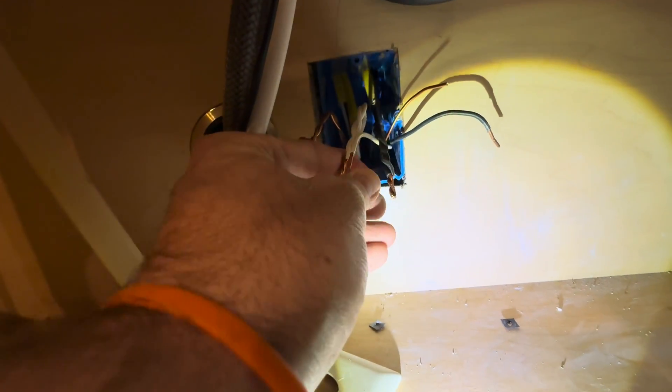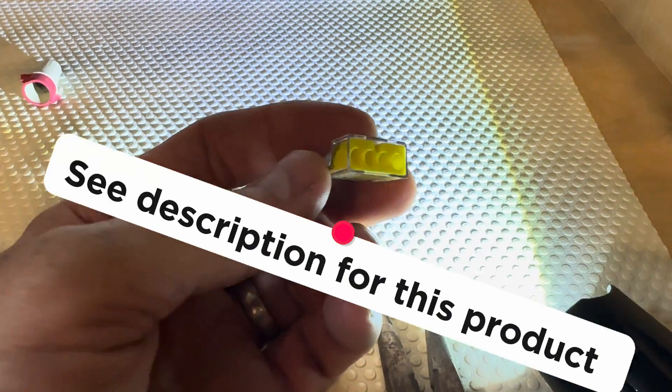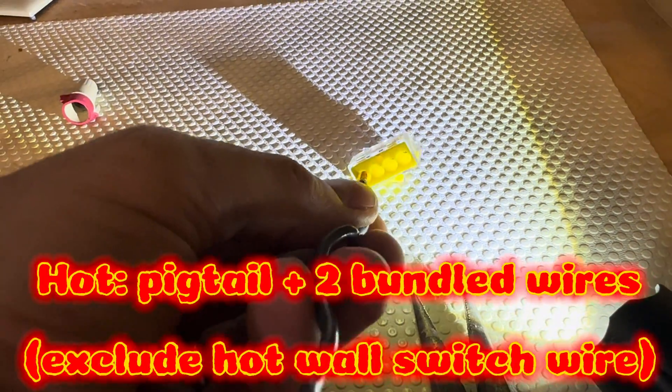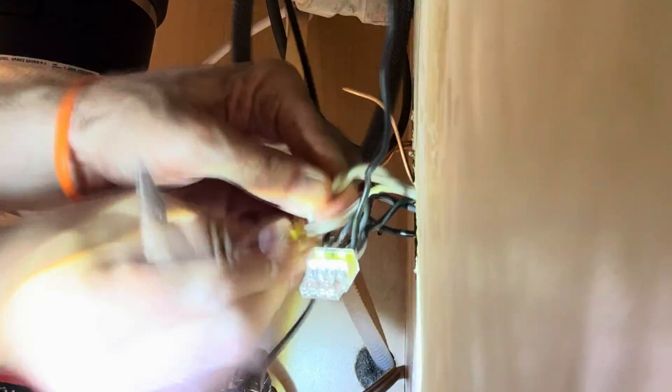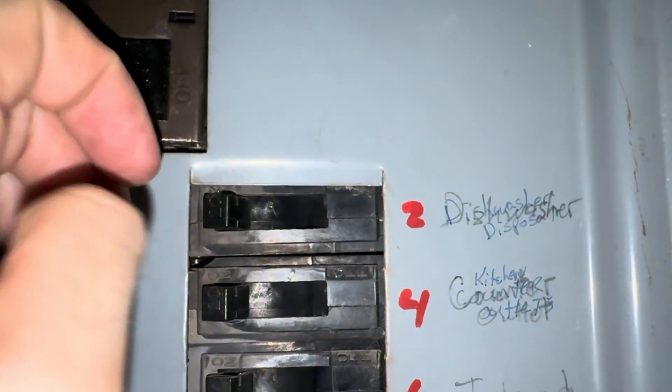I joined the two black hot wires from the bundles and added a third black pigtail. I tried twist connectors but there wasn't enough room underneath, so I ended up buying push-in wire connectors — highly recommended. For the black hot wires, I put my pigtail in and connected the two existing twisted wires — only three hot wires total, not the existing light switch hot wire. For the white connectors, I did all four whites into the same connector, and all four grounds into the same connector. My black hot connector had three wires, and both the ground and white neutral connectors had four. I popped the power back on briefly to test for live voltage — confirmed — then turned the power back off before proceeding.